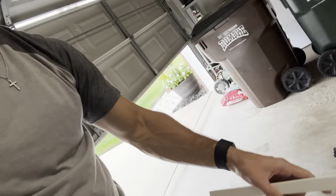It doesn't have to be absolutely perfect if you're doing this at your house. Definitely won't be perfect here either, but whenever you're done, you're just gonna put caulk where this meets the wall up here. You'll put caulk along the back and then caulk where the bottom meets the other side of the wall. So it'll cover any imperfections. If you're within about an eighth of an inch to a little under a quarter of an inch on each side, the caulk is gonna cover those imperfections anyways.